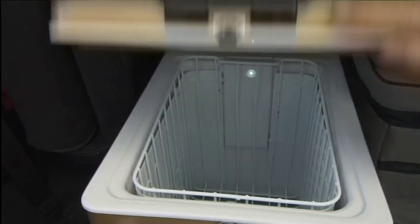Here's a tip: it's fine to power your Engel from a generator as long as you've got one that is automatic voltage regulated. Some of the cheaper generators on the market don't have this and are prone to power surges, which can fry your Engel and anything else for that matter. So make sure the generator you choose is automatic voltage regulated, like Engel.